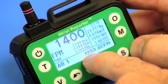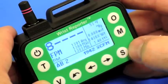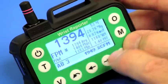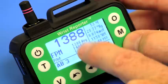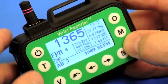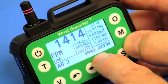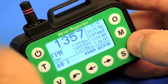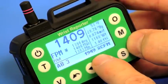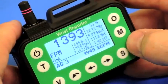If I press S to store a particular point of my traverse, I've stored 1399. If I store again and again, I've stored three readings and now have average, max, and min. The average of 1396 feet per minute times the 1.4 square foot cross-sectional area gives a CFM of 1949. So if we had finished a 16-point traverse as we climb down off the ladder, we would have the known CFM using this capability of the wrist reporter.